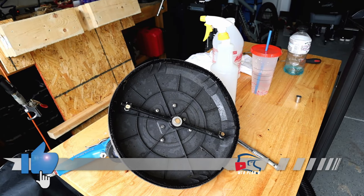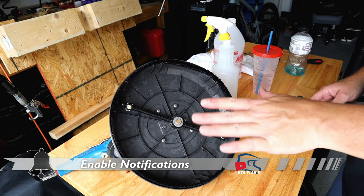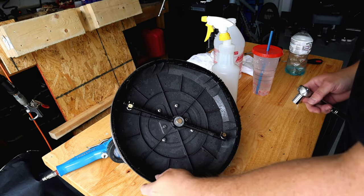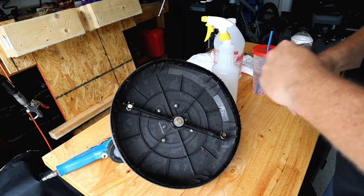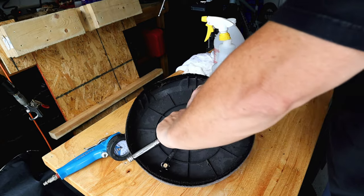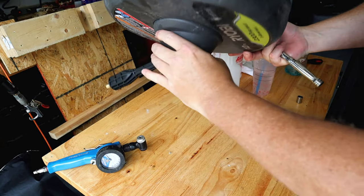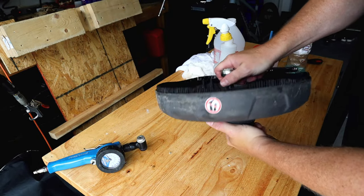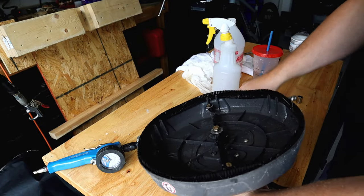All right, ultimately, if you use the thing long enough, you're probably gonna get it clogged up and it's gonna do exactly what you saw it do down at the bottom of the driveway there. So in order to resolve that, we're gonna take a 12 millimeter and come down here and remove the spray head. You're gonna get a good grip up here at the top, get your 12 millimeter and just unscrew it. It won't be on there super tight because it is a water nozzle.